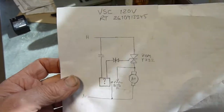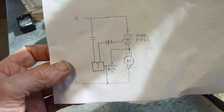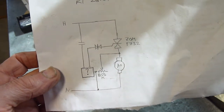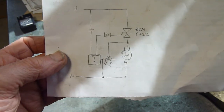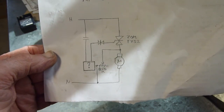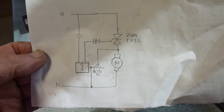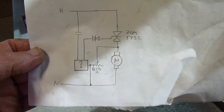Hopefully you'll find this circuit diagram helpful. What I would recommend: there are lots of triacs available that are the same physical size as the original, just limited to 1 amp — you're kind of taking a stab in the dark. But a generic triac with three-quadrant operation should be perfectly safe to use; it's a very simple motor speed control circuit. If there's a problem with the hybrid circuit box, you're kind of stuck. Other than that they are repairable, but it requires very fine soldering work. My only choice now may be to replace it or put an external box with a motor control and a light-dimmer type operation.